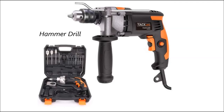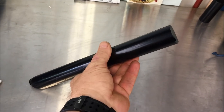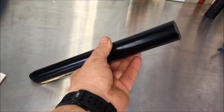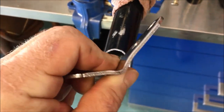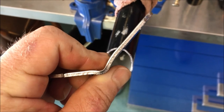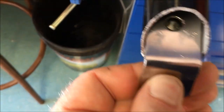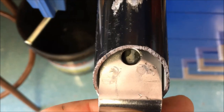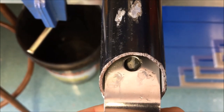I've cut this piece of fence tubing at a roughly 45-degree angle — I have to clean that up a bit and repaint it — but this gives me the angle I want against the larger fence post to brace it in the other direction. I bent a 90-degree angle bracket to about 45 degrees, then placed it at about the right location and marked inside this pipe so I can drill a pilot hole to bolt this together. Then I'll measure and drill the second hole as well.